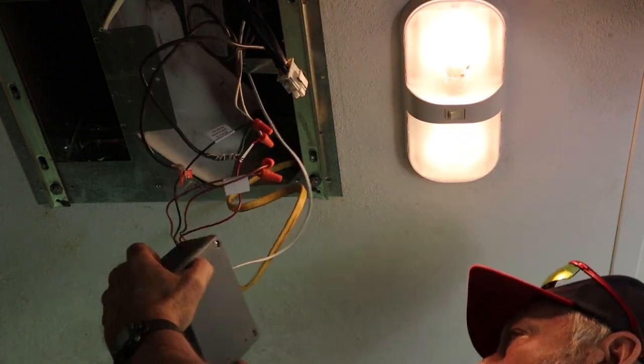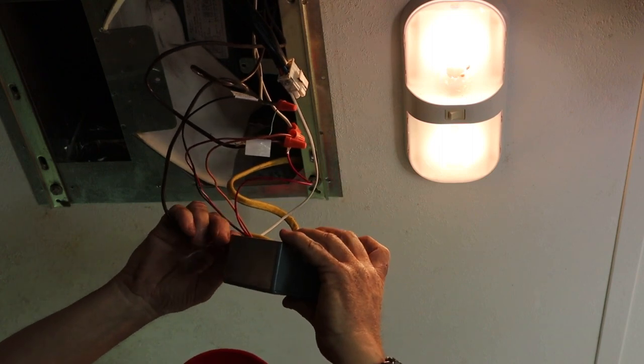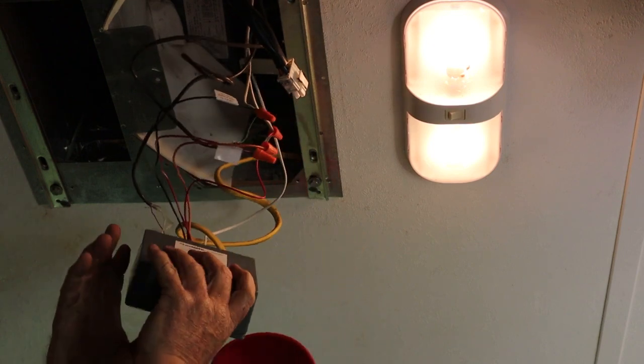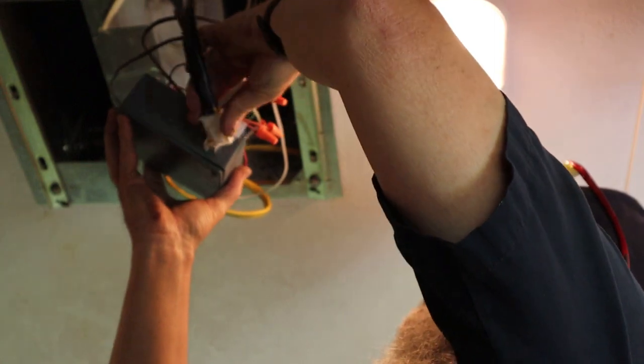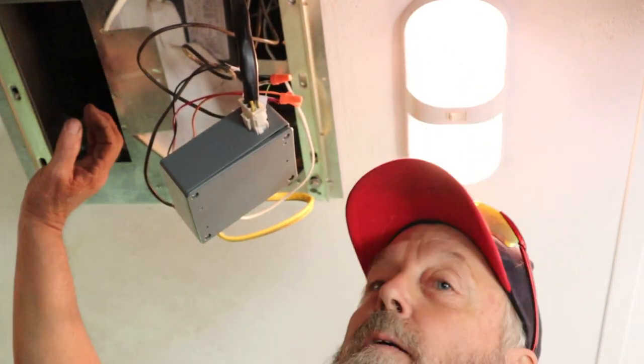We're going to hook up our two furnace wires that we put the spade connectors on. They go into our control box - it's the only place they'll go. And we're going to hook up our upper unit to our control box. I'm going to flip the breaker on and we'll see what happens. There's high fan. There's low fan. Now we're going to try cool. The compressor just came on. So she ought to cool. Now we're going to just try the furnace - we don't need heat today, but we're going to have to try.